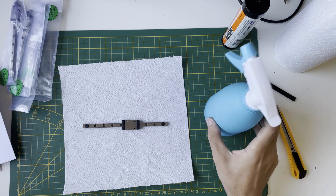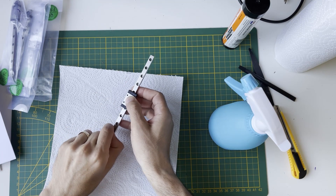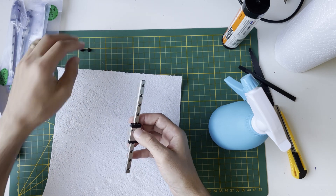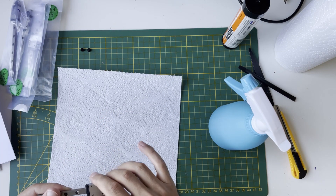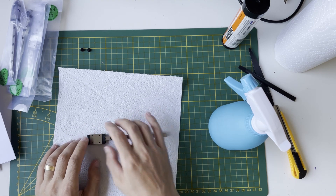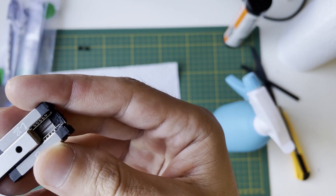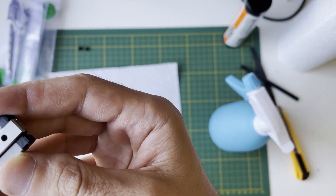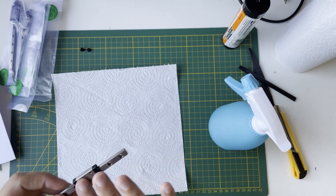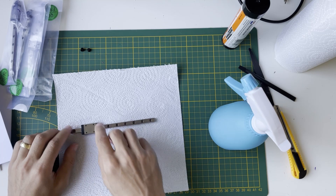One small correction: I will clean them with isopropyl alcohol, not WD-40. While I'm cleaning this I'm also removing the carriage. If you are not confident enough, just leave it as it is and clean them here, then move it and clean in here. It's really easy to lose the balls while removing or replacing the carriage, so if you're not confident enough just leave it as it is, clean part of it, move the carriage, and clean the remaining parts.